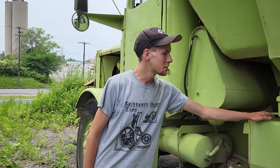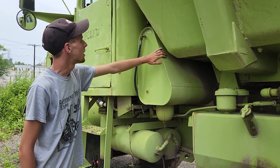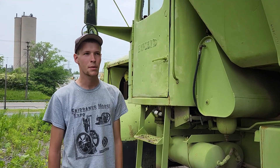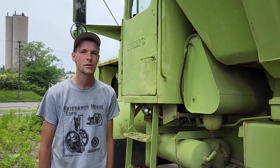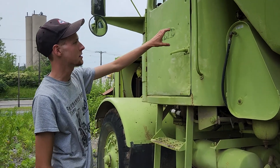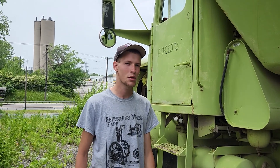This is your hydraulic tank — your hydraulic reservoir tank. This is your fuel tank. One thing to note about this that was a really good idea on Euclid's part was the fact that they put it behind the cab between the dump beds in case of any collisions. Because a lot of times they either had them below the cab or actually as part of the back of the cab on earlier trucks, and that was a big safety problem. So putting it behind the cab took away a lot of the safety issues, but still it wasn't perfectly safe.